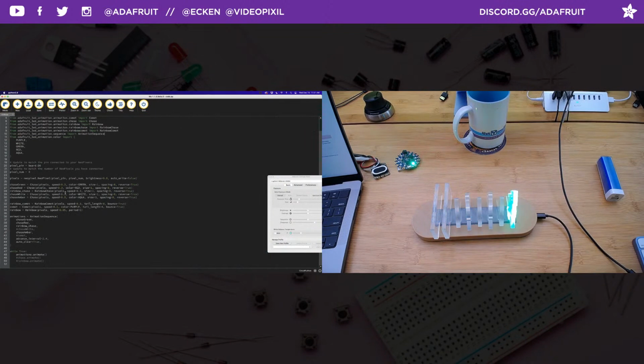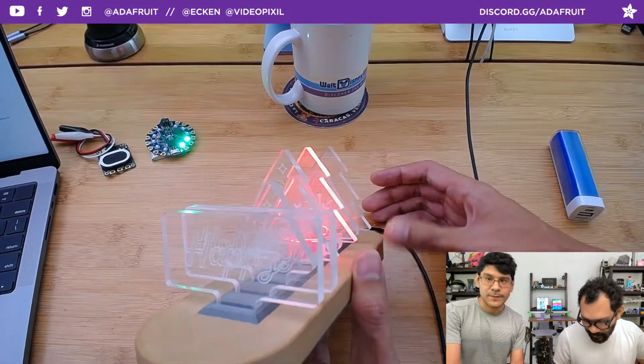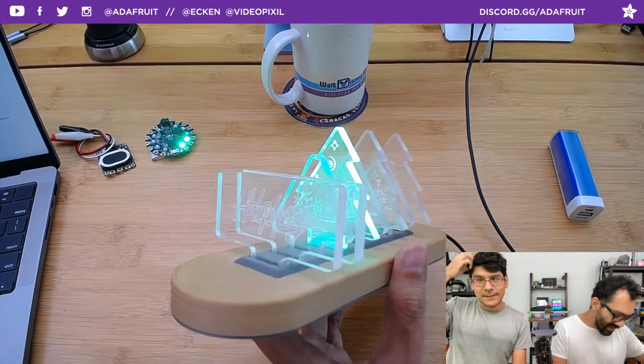All right, so here's Moo. I'm just going to change these speeds to 1, and it'll run through it real quick. You can see you have a couple of parameters to play around with in the chase animation module. You can reverse it, and change the spacing and the size. Right now, the size is set to 1, which tells me I'm going to light up 1 pixel per animation cycle. I've updated the speed to just 0.1 of a second. Let's see what that looks like in the overhead. Whoa. And there, you just have a nice speedier look. You can see why I slowed it down, just so you have some time to process what it's saying.